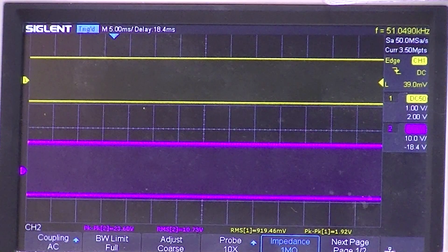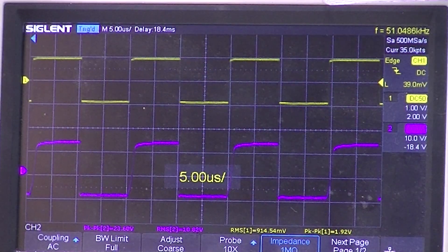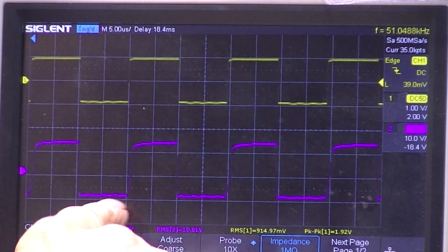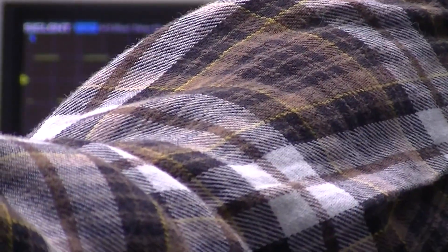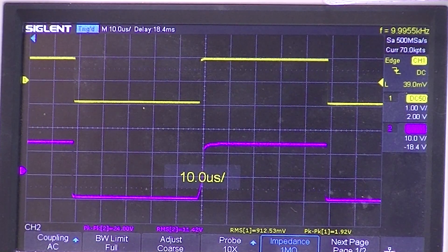Going to 50 kilohertz — this was the real test — and those square waves are almost perfect. There's a little noise but that's from the power supply. At 1,000 hertz, there's a clean square wave in and out at 996 Hz — it's perfect. At 10 kilohertz, also perfect.